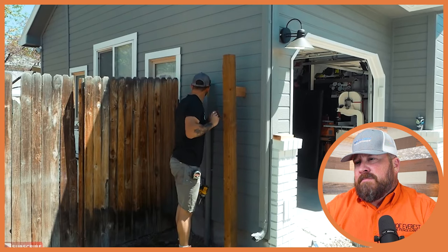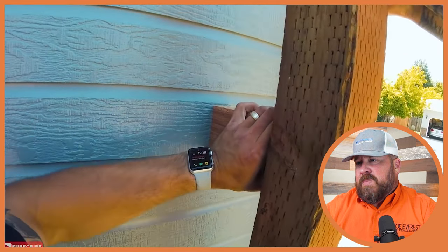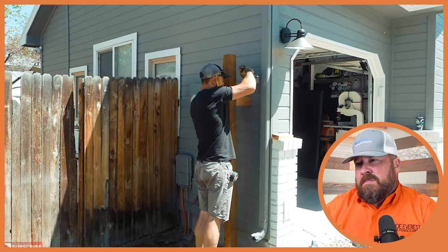For the post side, he didn't want to connect the post to the actual framing of his house, mostly because there's a gutter running through. He's using a spacer block on the very top. You know my opinion on attaching posts to houses — I'm not a fan. Generally you would want your post to be independent from the house. As the seasons pass, your house and fence posts are going to settle and rise in different measures, which could lead to damage to the house. If you set your post correctly with proper support, you don't need to attach them to the house.